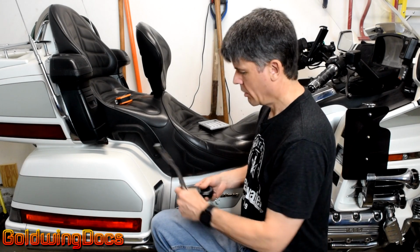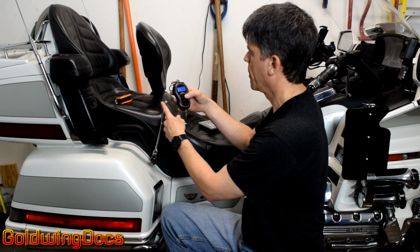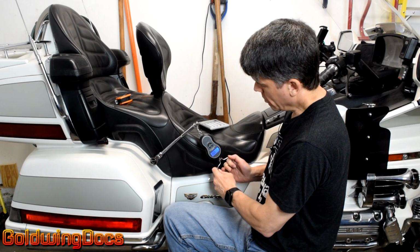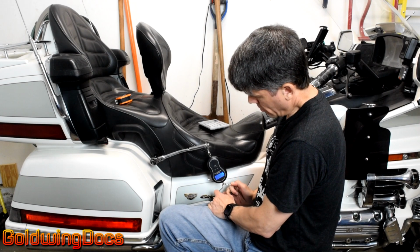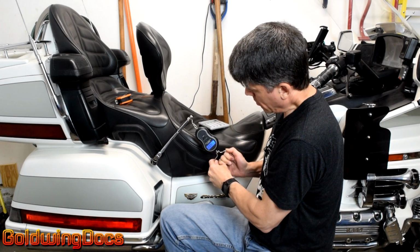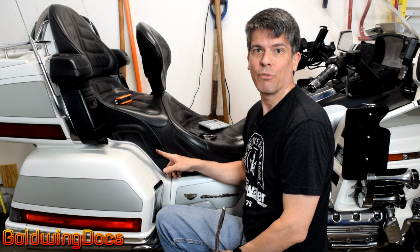So what I'm going to do is put my wrench in the fastener. I'm going to take my luggage scale, turn it on, wait for it to zero out, hook it on at that place that we measured to before, and simply pull it until it reads 20.7 pounds. And that's it. This fastener is now set to 16 foot-pounds of torque.